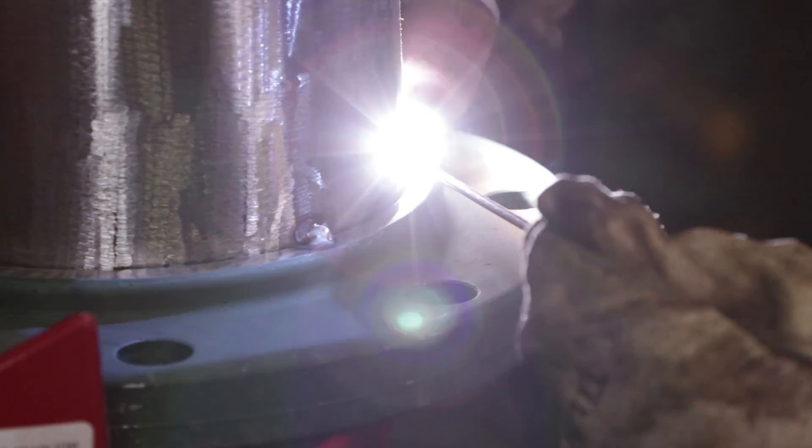Definitely not perfect, but it can do the job. Now I'm going on to the carbon flange. For the root pass here I'm running at 165 amps, using a sharp tungsten, and I'm using a 309 stainless-to-carbon rod to give you all some color. Usually you're going to run it with some ER70S-2 filler rods, but I just want to show y'all and give you a good quality weld.